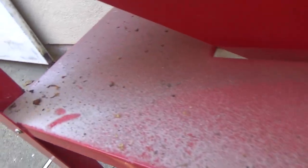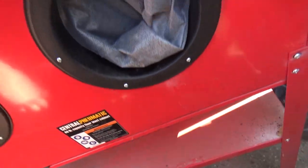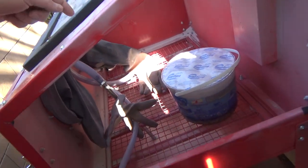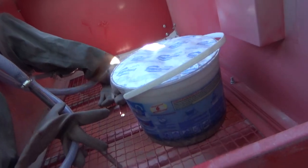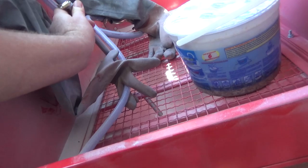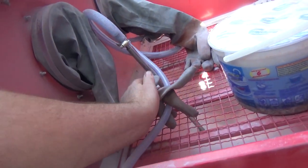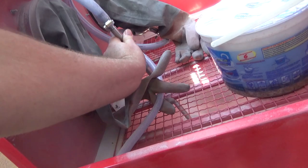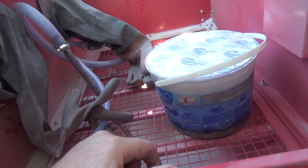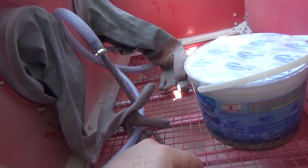It's especially bad down here in the corners underneath. The light is not great — I've got this outside in my easement and the sunlight makes it very hard to read. The light never worked properly. I keep desiccant in here to keep the media dry. But the first major complaint is that the take-up never really works very well; it constantly struggles with getting media into the blaster. Maybe only 10 to 20% of the whole time you're using it do you actually get media.